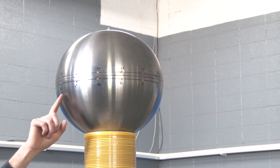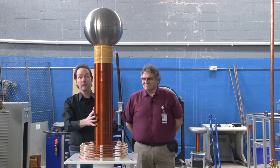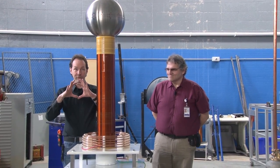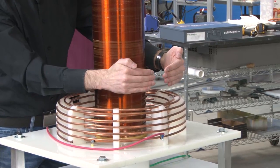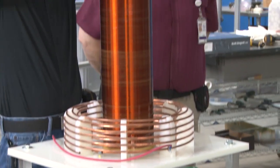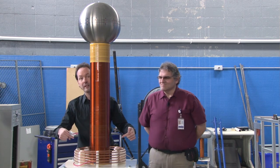Or you'll get primary strikes, which is where this can either come out and hit here — really bad — or come out from here, go down in a racing arc, and then jump out and hit the primary, which is really bad. You don't want to have anything here making an electrical connection to anything here. When this is all done it'll have what we call a strike rail. A strike rail is just an open loop of copper pipe — you don't want a full loop because that's a shorted turn and it'll suck huge amounts of energy out of the system. So you leave it open, just a one or two inch gap, and connect that directly to your RF ground. This green wire is our RF ground. You just dump that out safely, and that protects you. If you have a coil prone to primary strikes — usually because your field shaping is poor — you just put a primary arc ring out here and it'll just hit that and dump it out safe.